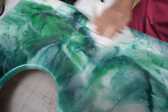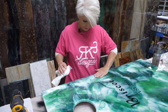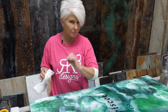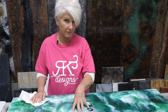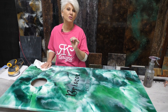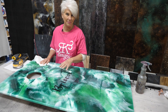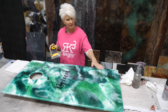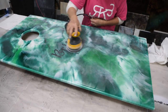I don't see the fly. The telltale is if I can rub my hand over this and not feel a really big divot. If it's a little bit of a wave, I'm really not worried about that because I know I'm going over the top with the ultimate top coat — it's a fabulous product to hide tiny little imperfections. I'm super excited it came out like this and I don't have to put another flood coat. So now I'm going to give the whole surface a light sanding and then we'll get ready to put the ultimate top coat.